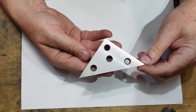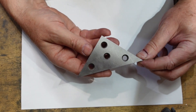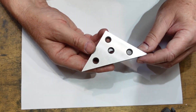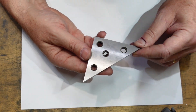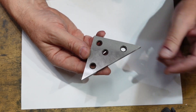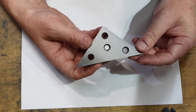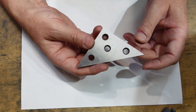Now of course you need to trim your vise jaw up, but what that means is that you can mark something out on a piece of plate, set it up like this, machine down to that line, and away you go. Those of you who have watched a number of my videos have probably seen these being used before — it's just a solid square, a quarter inch thick, 45-45-90 degrees. One of the things I've been trying to think of is how you would make one of these yourself, and with this tool it becomes a lot easier.